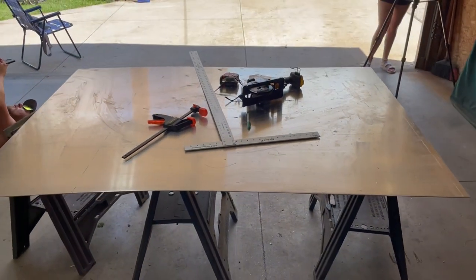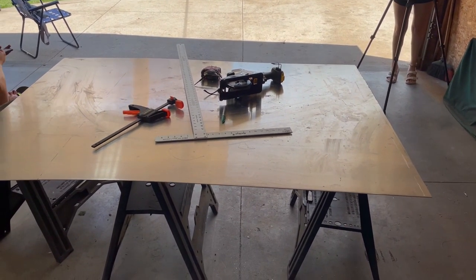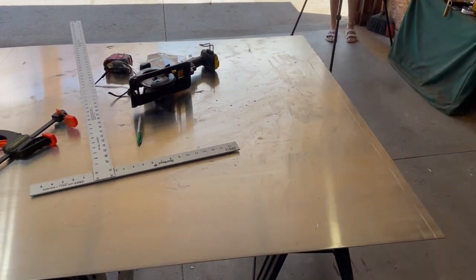So back here this will be the back of our taper on this side — 52 inches wide. Up front it'll be 49 for the front of the boat since it starts to taper. We've got a very slight angle going back. Hope you guys can visualize it. This will be from the back of the boat — hope you guys can see the lines we drew out very faintly. We should only have to make two cuts here.